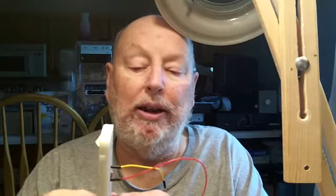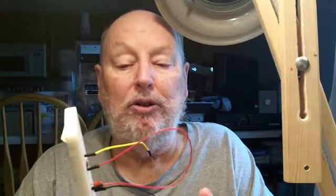I think it's exactly what we needed. So we know now exactly what to use for our circuit on our power supply, and that will work out rather nicely, I do believe. And the only thing I didn't really cover too much on this was the fact that the anode and the cathode of the LED has to be correct for it to light up. If it's backwards, it won't light. No harm will be done as long as there's not excessive voltage applied to it. But for our intents and purposes here, all you do is reverse it and everything's fine.